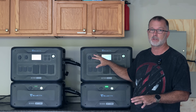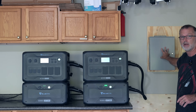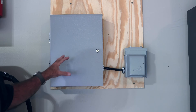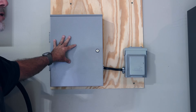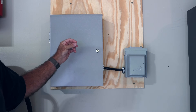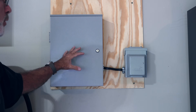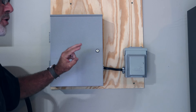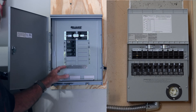In the context of a home backup power solution, you'd also probably want to use their home integration kit, which is this guy right here. The home integration kit for the AC500 is a little bit different than the one for the AC300. This one is designed specifically for 50 amps. Depending on which version you get, you get the same box but you can order it for a 120-volt configuration with a single AC500, or for a 240-volt version that comes with a different set of cables assuming you'll use two AC500s in a 240-volt split-phase configuration.